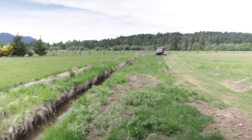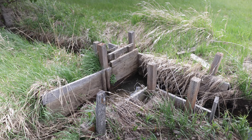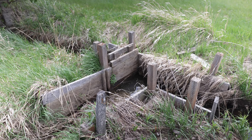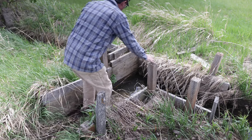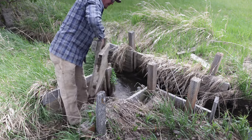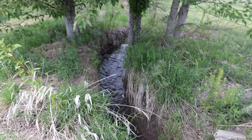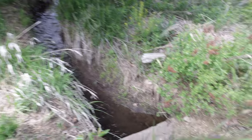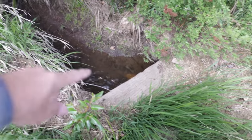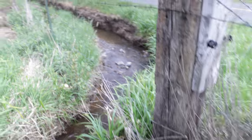The first gate's up there at the quad, the second gate right there in the middle, and here is the third — this is the one in the worst shape, probably where we'll start. I'm going to start by replacing all the rotten boards. The gates themselves are getting pretty rough and falling apart; they're not really sealed or holding water anymore. Once the field is watered or we've taken all that we want, the overflow or excess water goes through here to this culvert, which cuts across and goes into the main ditch that parallels the road.